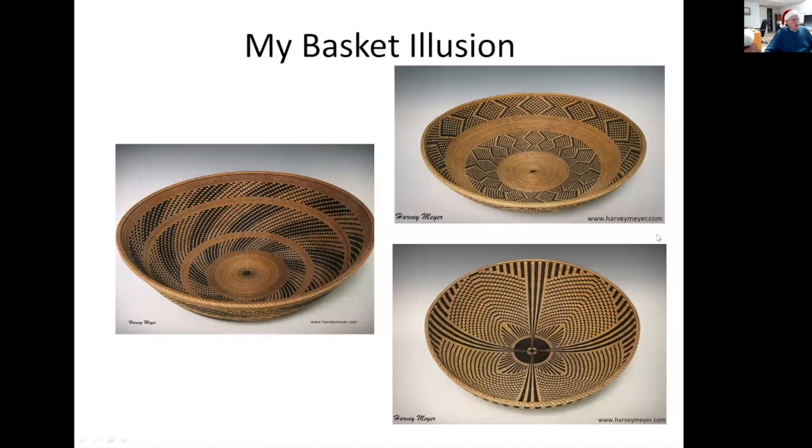These are some very large bowls. These are about 15, 16 inches in diameter. They're Bradford pear, and they were turned while the wood was extremely green, literally fresh cut wood. I did the beading right away as I was turning it. And then I put it away to dry. And when it dried, they warped considerably. So these pieces are a good inch more in diameter with the grain than they are across the grain. And then they also warped in the height of them. So they have a much more natural basket look to it because they're not perfectly round.